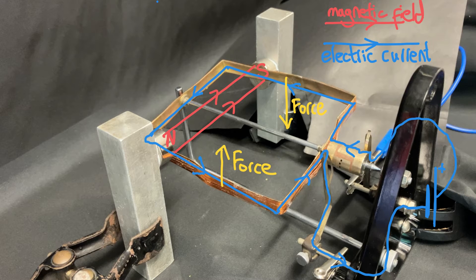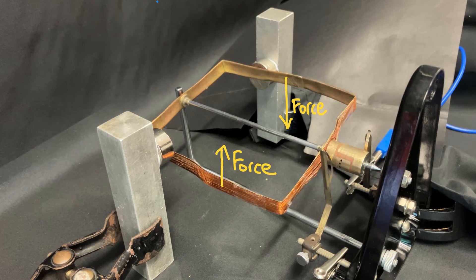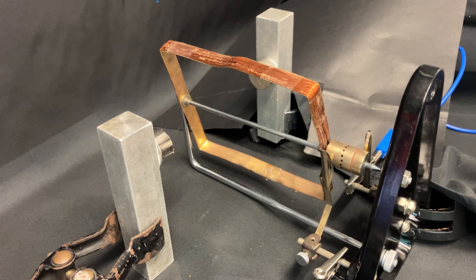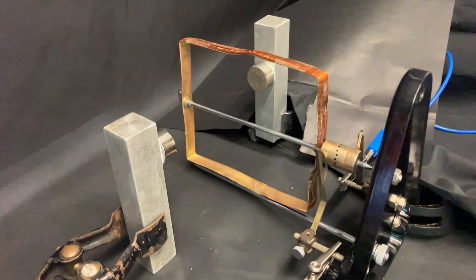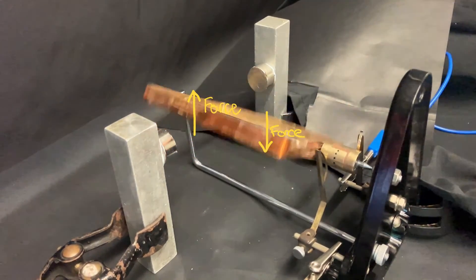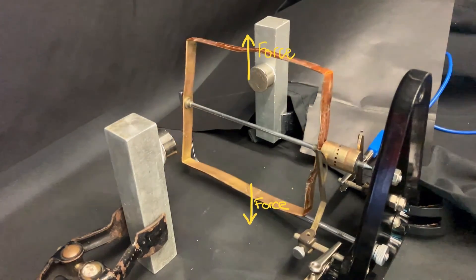So let's turn it on and see what happens. It's clear that the coil does half a turn and then comes back and stops in the vertical position. All is good to begin with, with the two forces creating a clockwise turning moment to make it rotate. But when the coil passes the vertical position, the moment is actually acting in the anti-clockwise direction, which causes it to slow down and come back to the vertical position.